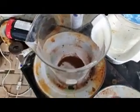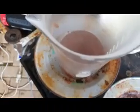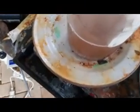All right, this will be the second water wash. And I noticed after using the hydrochloric acid that it granulates a lot more now. It's not so powdery. So this will take hardly any time at all to settle. Whereas when it was a dust, it took a while. You can see the colour's even different. It's brown now, which it should be, instead of black mud. It's a nice, chocolate brown powder. That's how it should be. So it's almost settled already. So we'll give that a few minutes.